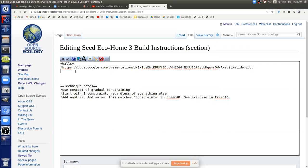You can't, say, build the frame already so that we have a frame that can parallel. Once you put the plywood on, you can't really start four corners well. You want to fix one side because everything is adjustable outside of that degree of freedom. So that's a definite procedure point. And start with the one that's supposed to match with the next wall. It's more important than the bottom side or the top side. I find it easier, but I don't think it matters really because both of them have to be aligned at the end of the day.